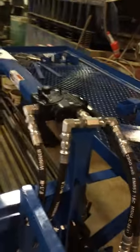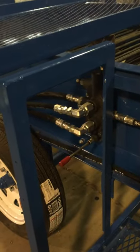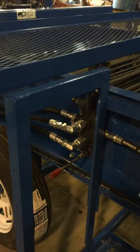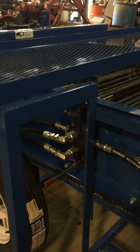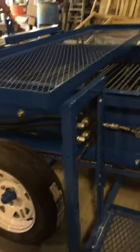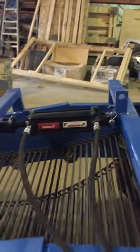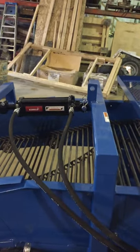This is a flow control for the chain, and when we get running I'll operate that. This is the tail lift cylinder — instead of the tractor driving it, when the operator pulls the front end out of the row, the person on the back will pick it up at the end of the drill and it'll be all the way up. That can be adjusted — right now it's in that position and it'll lift up higher if the cylinder is moved to the top hole.